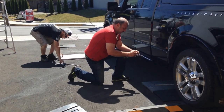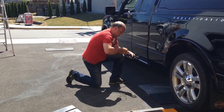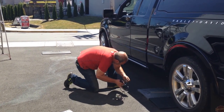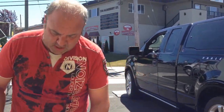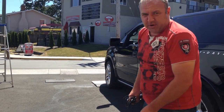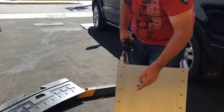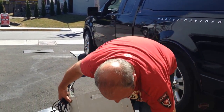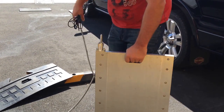I'm unwinding the cable because it's going to take most of the time. I'm going to throw that across. Keep in mind that when you do scale, you make sure that you don't ever run over your sensor — very important. So make sure your tires are here or further this way. If you're using duallys like on a five ton truck, they can hang over a little bit and it'll still give you an accurate weight, but just make sure you don't go over the sensor, otherwise you'll need to get it repaired.